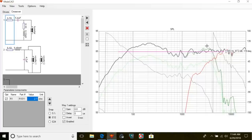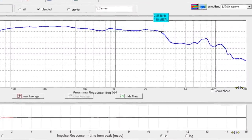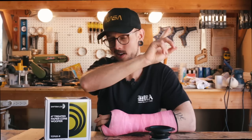Just select a tweeter, throw them both in VituixCAD and you're off to the races. This could also be a great contender for a two-way T-line enclosure. Just don't forget about that tweeter, because this thing is nowhere close to full range. The cone starts to break up around 4,000 hertz, but that's plenty of breathing room — even if you want to use a budget tweeter like the Dayton Audio TD20F. I'm actually right in the middle of a two-way build using both these woofers and that tweeter; I'm filming the whole process.